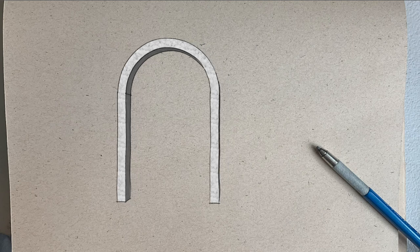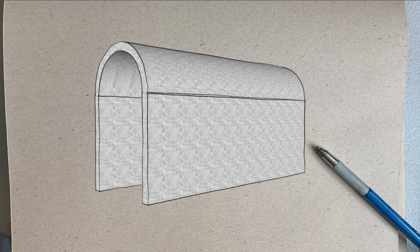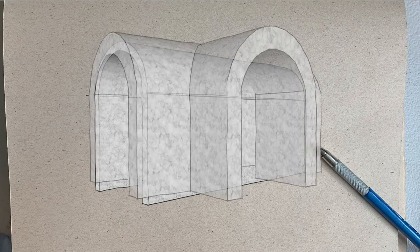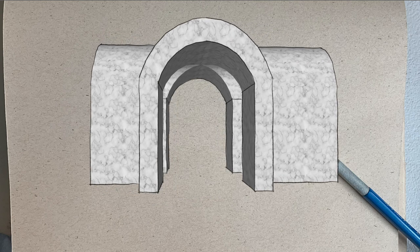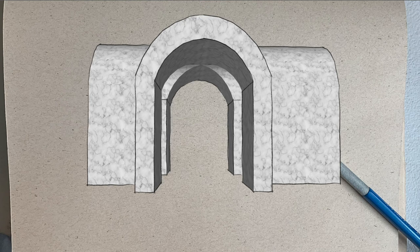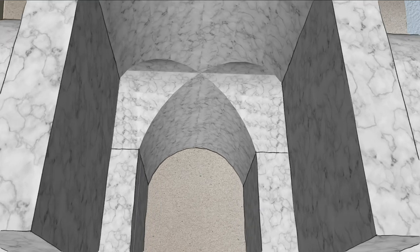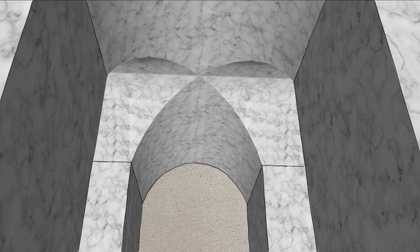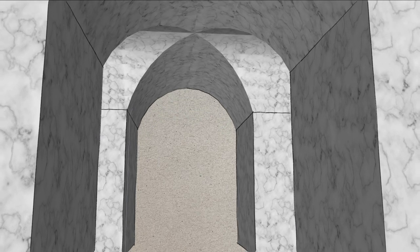This mixture allowed them to do four different types of structures. The first is the barrel vault, which is essentially taking an arch and repeating it over and over again until you get essentially a hallway — the more arches you have, the stronger the building. Expanding on this idea, they took two barrel vaults and crossed them together for what is known as a groin vault. You have the four arches that make up the entrances of the barrel vault, and where they cross, you get this X formation — two arches crossed over at the center of the groin vault.